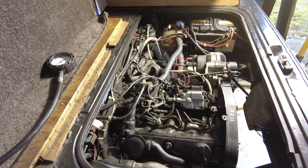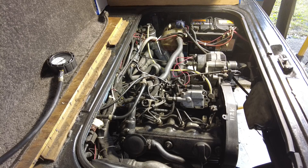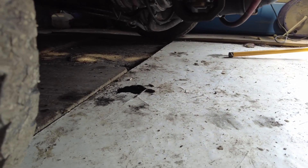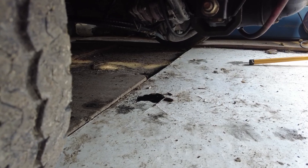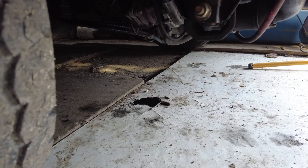I have a new exhaust to fit to it as well, by the way — it's in a box beside me here, so that's why the engine's not sounding great, because the exhaust isn't on it. The turbo does make a nice little noise though. Looking underneath now — with no exhaust on it, look at the oil dripping from the bloody turbo. That's from the exhaust side of the turbo, not from the bearing housing. So if it's leaking on the turbine side, you can be sure it's leaking on the compressor side as well.